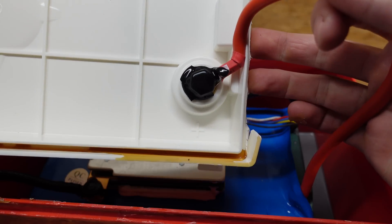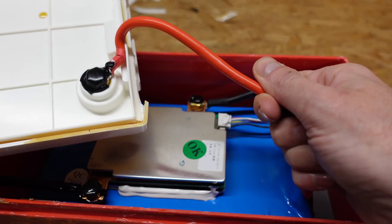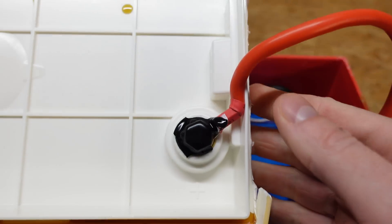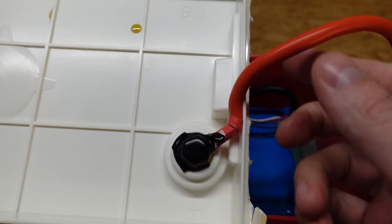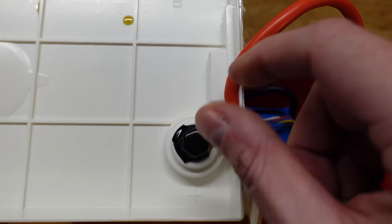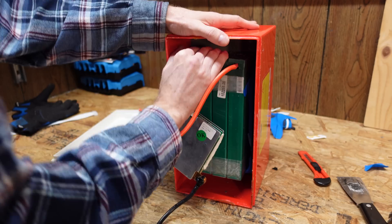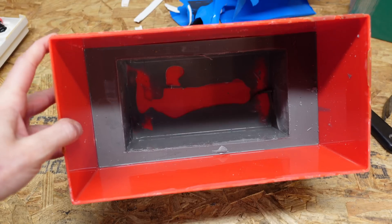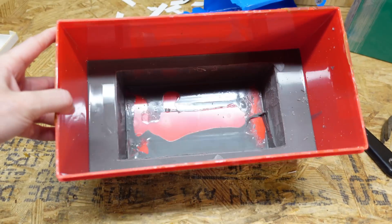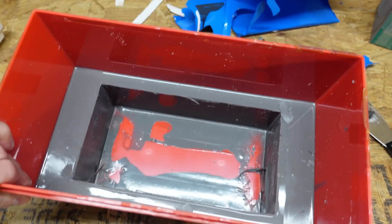The main positive and negative cables are seven gauge conductors with silicone insulation rated at 200 degrees Celsius. They are crimped onto a lug, which is bolted down to the bottom side of the terminal. They really should have held this cable when tightening it down to prevent it from spinning at this sharp angle. But look at the amount of rubber in there — that's a lot.